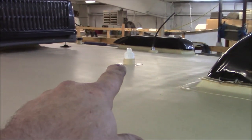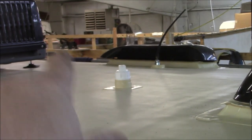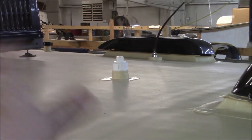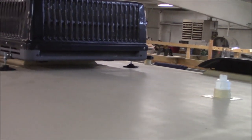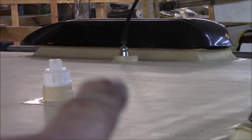We've got the stands on all of them for balance. Same thing with our curves for a vent — all heat-welded. This little guy right here is solar prep — he's anticipating putting solar, so we ran some wires. You take that cap off, unscrew it, and the wires are right there to service. We did the same thing with the radio — see how that's in a boot? Everything's in a boot. On the edge there are two layers of caulking: this is actually glued — this termination bar, this metal gutter rail has caulking behind it that oozes out; we strike it down. Then we go back and put one more strike over it, then another strike. So really there are three passes. We went around the whole entire coach — around the lights, windows, everything — to make sure this thing was sealed up tight.